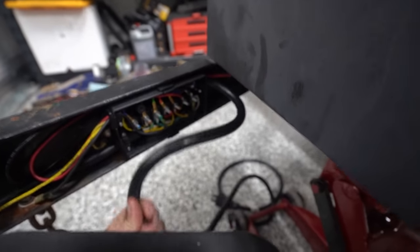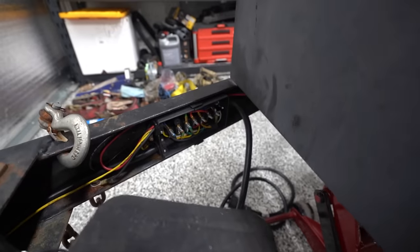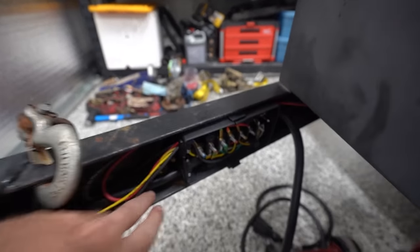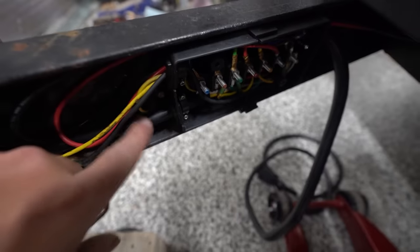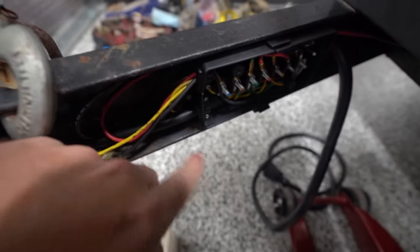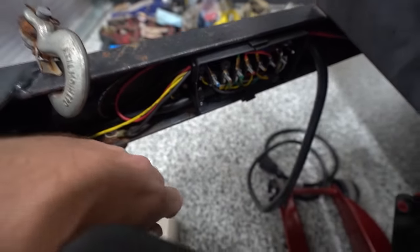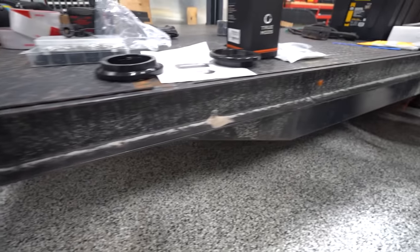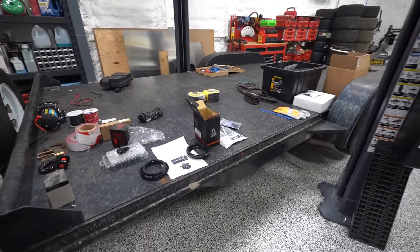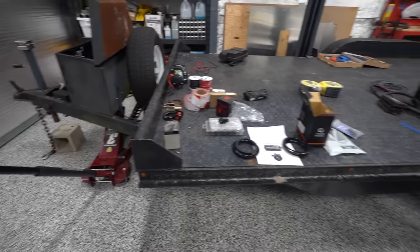So we're gonna make that longer to better work with the full size trucks. When I did it originally, I was towing with the green truck. So one thing I decided to do this time is get a 7-wire sleeve, basically just like that lead, to run to the back of the trailer. So it's nice and protected and out of the elements. So we're basically rewiring the entire trailer with the exception of these side marker lights. They are kind of a pain to wire and we'd have to split that loom apart every 2 feet. So we decided to just leave those, but we're replacing everything else.